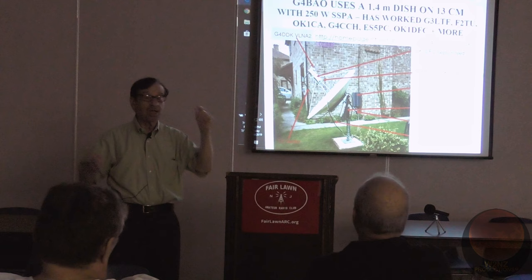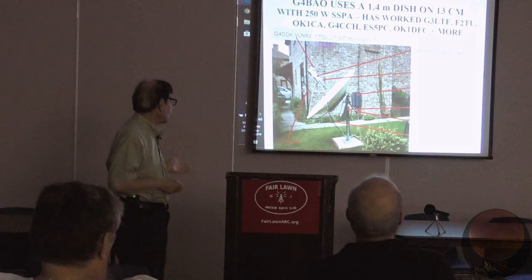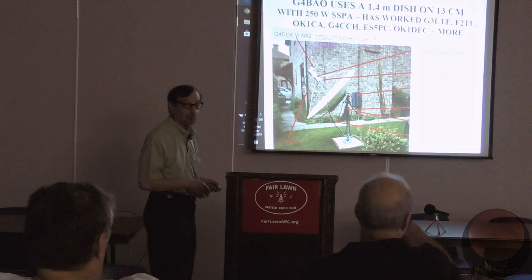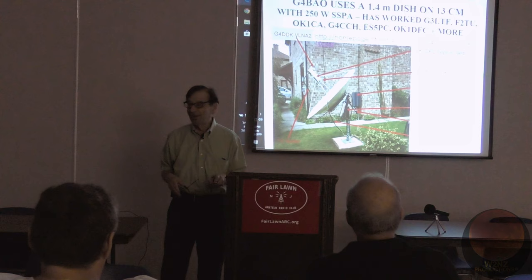But as you go higher and higher in frequency, your wavelength, which is inversely proportional to the frequency, gets smaller and smaller and smaller. And so the accuracy of the surface becomes more important. Fortunately, there are a lot of dishes around, in many cases for the taking. I know so many people who have said, oh, they see a dish someplace, and they ask, do you want that dish? And people will say, no, please take it away. They're happy that you come in and take it. They'll almost pay you to take the dish away.